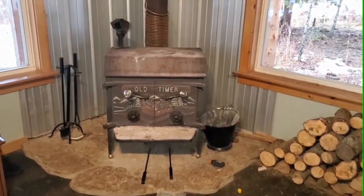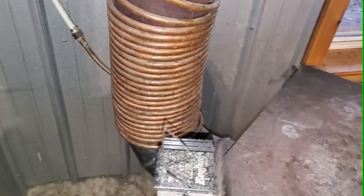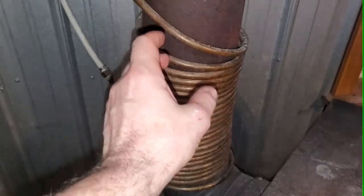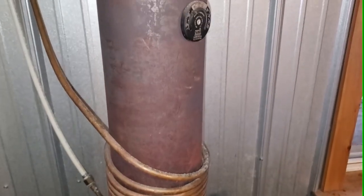On the back of the wood stove, what we've built is this copper pipe and I've coiled it around — you've seen that in the past video. It's just a flexible copper pipe wrapped around in tight coils. The concept is that the heat's coming out of here and leaving anyway — it's not robbing any heat from my house. That's why I call this free heat: this chimney is hot anyway, the heat goes up and out the house, and by wrapping this coil around it I'm just absorbing some of that heat that would otherwise be lost. People have asked about creosote issues — no, none, I've never noticed any.